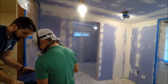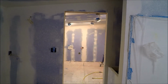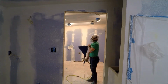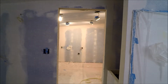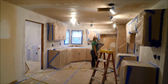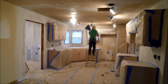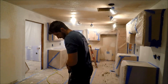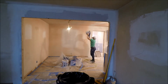And this is it. This is the final texture time. Right, texturing time. I had never used a texturing gun before. It was interesting. The big funnel is funny. It's full of watered down mud, and it's probably the quickest part of the entire drywalling process. I did that in one day. Retextured every surface, and you did it in a very short day. It took three or four hours, I think, to do the entire house.